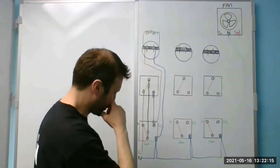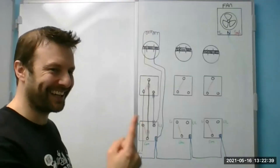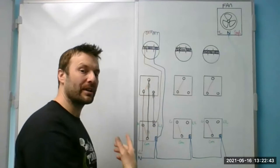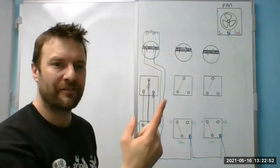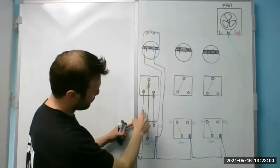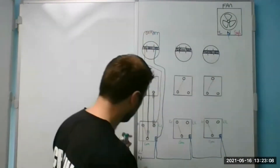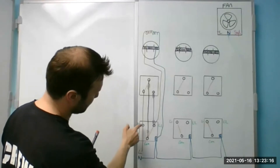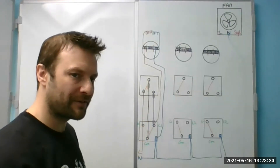Is this light on or off? It'll be off. So we have to use our 'electrician's finger' — physically trace it and follow the cable. When I first started, I'd be on site going: feed comes into this light, comes down to the switch, goes back, and I'd follow it around with my finger. Eventually you can do it in your head. Now if we follow: supply comes in, goes straight through and loops — at no point does it touch L2. If I switch it on, the strappers turn it on — feed comes through L1 onto this L1, through this switch and down through the strapper.